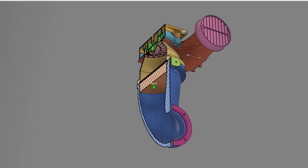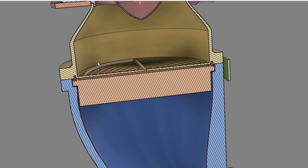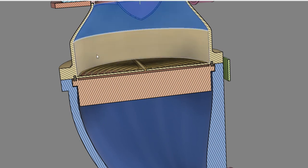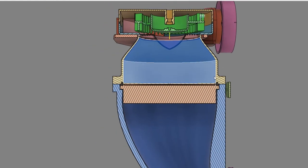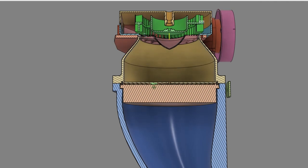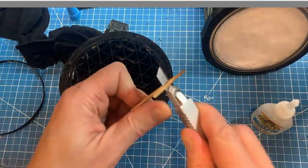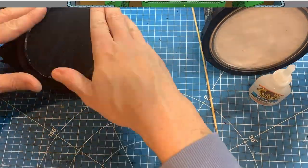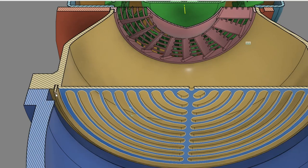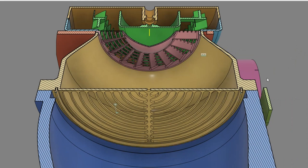The second stage has about 50 to 60 millimeter deep bed of activated charcoal. I wanted to have a lot of charcoal in there so that it would last a long time, as well as slow the air down so that the charcoal has a chance to actually absorb any of those VOCs coming off the plastics. I have a grid on the bottom of the second stage and a ring around that which gets glued in separately. This ring goes in after you stretch some women's pantyhose over the bottom section and glue that down, then glue the ring in. This helps to retain the smaller charcoal particles and the ring itself helps to seal against the rubber portion of the vacuum cleaner filter.